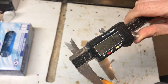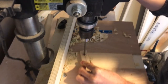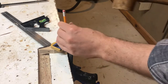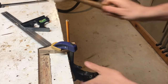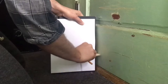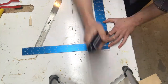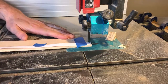The door that I'm putting the dog door into has some shape to it that I need to trace out, so I'm gonna put together a little tracing tool by just drilling a hole in this little piece of scrap and cutting the other end to a point, then hammering a pencil into the hole. Erasers are not necessary in this application. I'll make a little template out of that tracing by just cutting it out of the piece of paper and fixing it to a piece of scrap quarter-inch plywood.